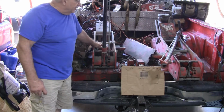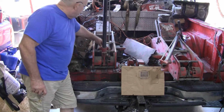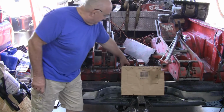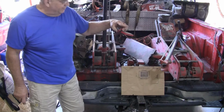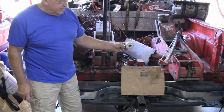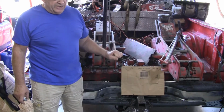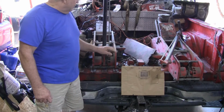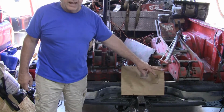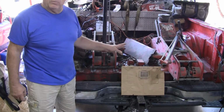There's one main cylinder, and I suspect that the main cylinder might be bleeding down, so we're going to go ahead and put new seals in the main cylinder. These are parts from the pneumatic aspect of the lifts. I'm thinking we just need some new ones. So we're going to clean them up, put some seals in the cylinders, weld this handle over here, and then we'll do another evaluation before we try to return them to the customer.